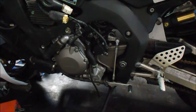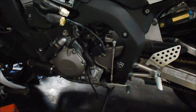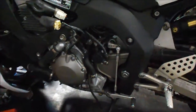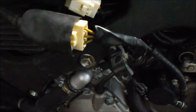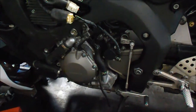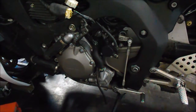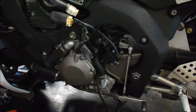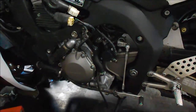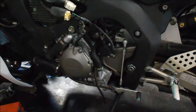This here's a 2005 Honda CBR1000RR. It's currently experiencing no charge going to the battery. We did check the stator — these wires right there. The voltage coming out of those wires is between one and two volts at 5000 RPM. We do have another stator to put on. It's from Rick's. They said it would work with the old or the new flywheel, so we'll see.